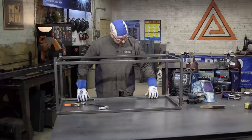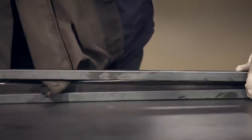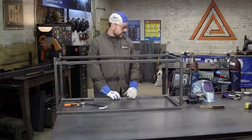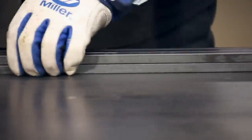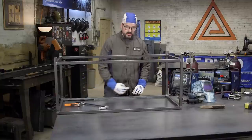Everything is half inch, so your half inch spacer is also a half inch. We just rest this on top of a half inch square bar, then clamp and weld it into place. We're going to tack at the ends first to secure it, then everywhere I have prepped the material, we're going to put two tacks and then connect the two tacks together.